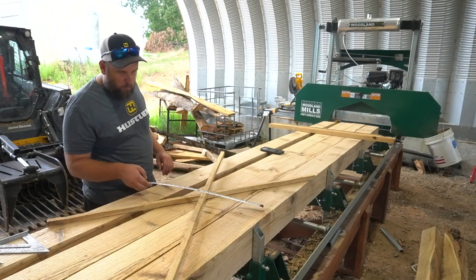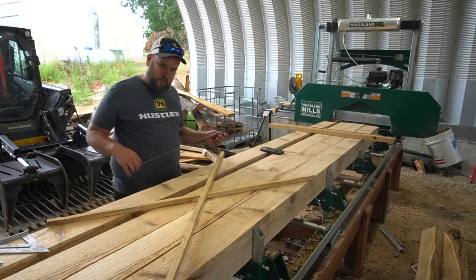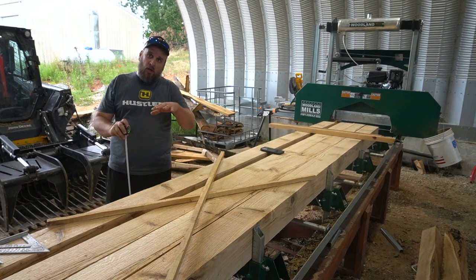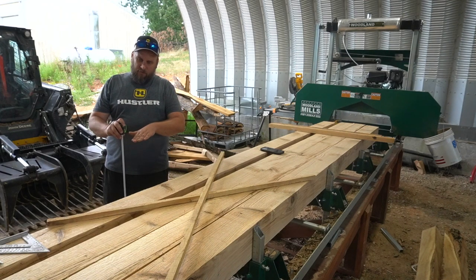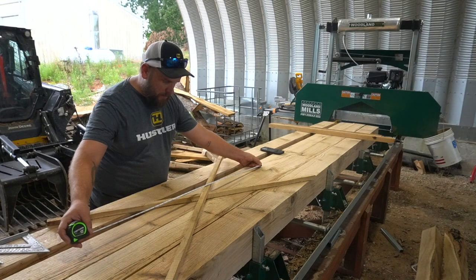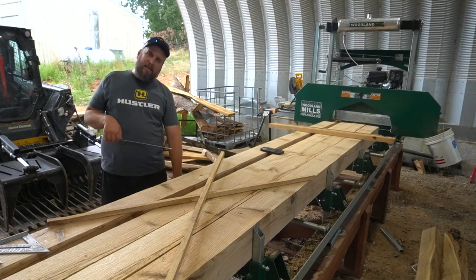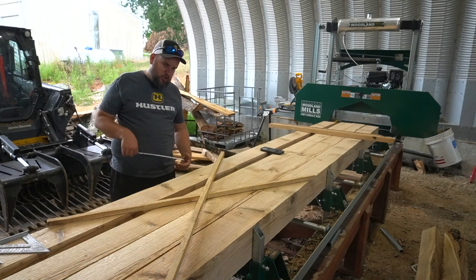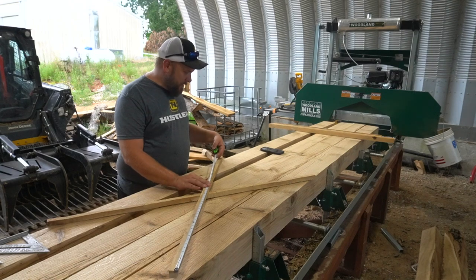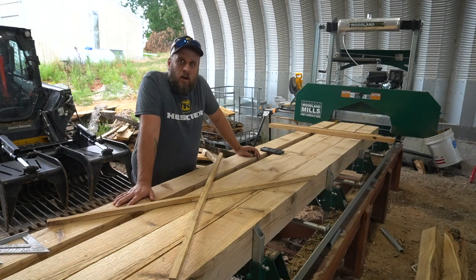With the opening at 25 inches at the top, and that same 25-inch measurement factored in, that will make this entire rack 47 inches tall, which is a pretty comfortable height. If you make it too tall, you're putting all that weight way up high — you really want to be cutting around waist height, so the top of the rack being 47 inches should be really good. With the way this X is laid out, it's going to be 24 inches to the middle. I cut these two pieces to 53 inches because I've got a bunch of oddball widths and thicknesses that are 106 inches long.